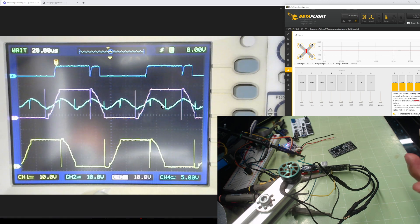First, the easy stuff. When it's 100% duty cycle, easy to detect because there's no breaks on the signal — it's just 100% duty cycle. It will be a continuous signal going up, and a continuous ground. Even though it's fluctuating up and down, there's no breaks unless there's a commutation event. Here's a commutation event, here's another one, here's another one — every time it commutates, you can see the signal gets disrupted.